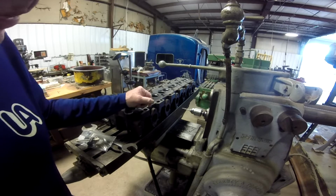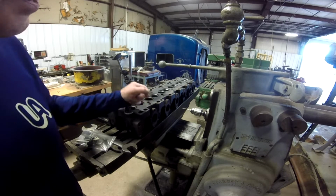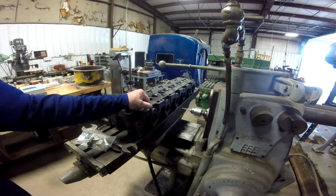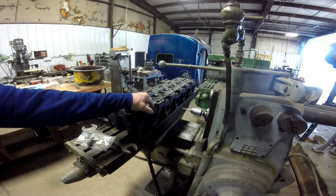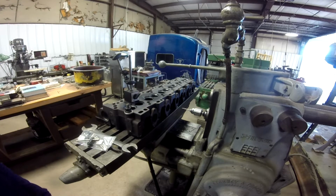I didn't videotape it, I just drilled it hoping that the left-hand drill bit would pull it out as it bored into it, but it didn't. You know, I was hoping, but in the back of my mind I kind of knew it wouldn't. Exhaust studs are a bitch to get out. I mean, the heating process of the exhaust ports kind of bakes them in there, and you're not going to get it. It'd be very unlikely that you got it out with a left-hand drill bit, but hope upon hope, I kind of figured that it might work, but it didn't.